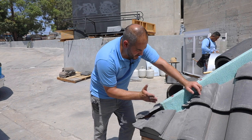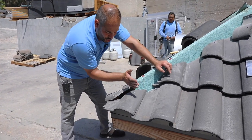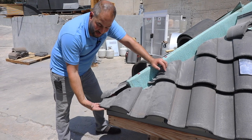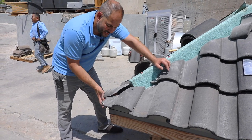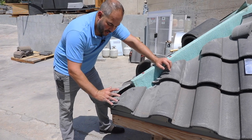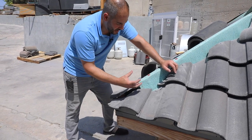The number one thing we've done is we've stopped our 2x8 short. What this is going to allow us to do is bring our tiles all the way in. So when you're looking from underneath or from the sides, we have a symmetric roof. It's also going to allow us to put our mortar head here to start our hip off.